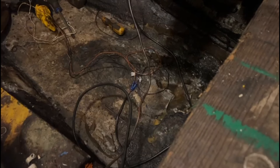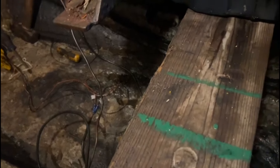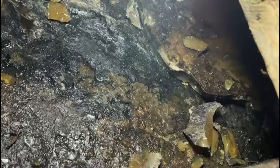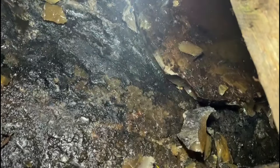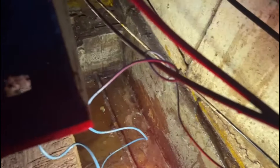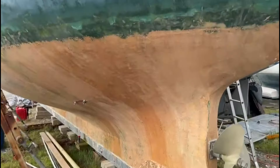We're down to concrete, which is the original ballast. They've obviously just poured this resin over the top and it's not adhered at all. You can actually see how thick the stuff is — it's two to two-and-a-half inches in places. I've just got this last little bit at this end to crack out and then I can decide how I'm going to repair it, maybe just matting over the top to seal it. In the meantime I need a break, so I'm going to look at the coupling at the back, the prop shaft, rudder, and prop — I get the feeling it all needs doing while I've got the engine out and access to the back.